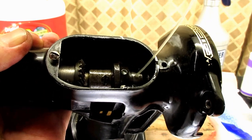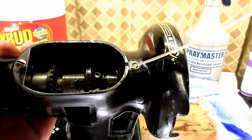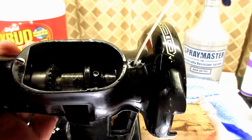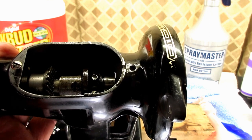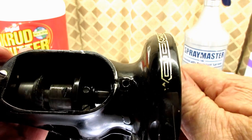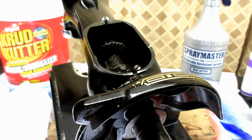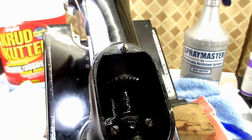And on the eccentric. And I'll put my tube down in the porthole and just put a couple of drops down there on the bushing for the arm shaft. Whee! Oh boy. I think that bushing was a little dry. So now we're talking, huh? Get my light up here, maybe I can see this a little better.